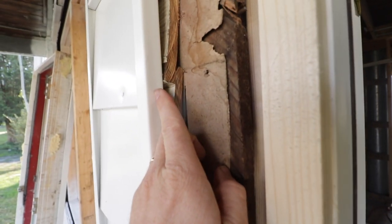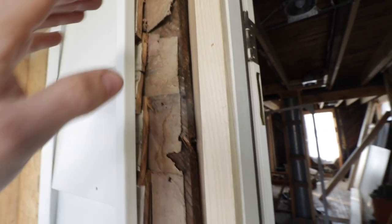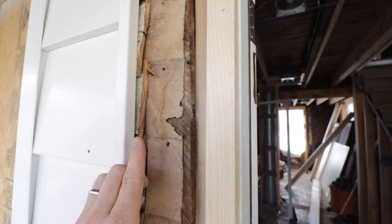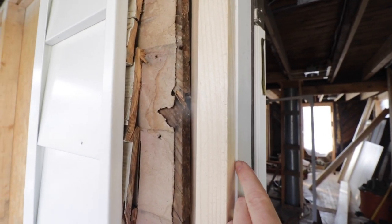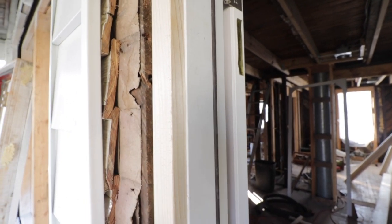Then I'm going to rip a small strip because 1.5 inches is how thick a 2x material is. Comes out to about here. So then I'm going to rip a little strip that kind of borders the whole thing, and then it's going to get caulked and painted, and it'll have sort of a profile, so it'll stick out the most past the siding. Well, not step down, it'll step back to this, and I set this back about 1/8 of an inch to give me a little kind of a caulk joint that'll hold the caulk better than if it was flush and I just smeared caulk over that seam.